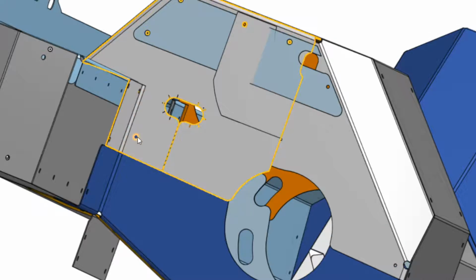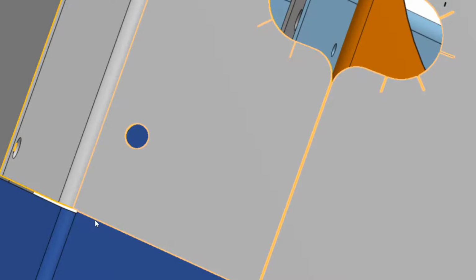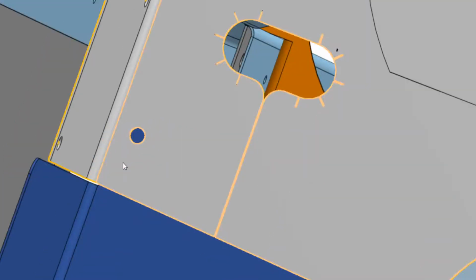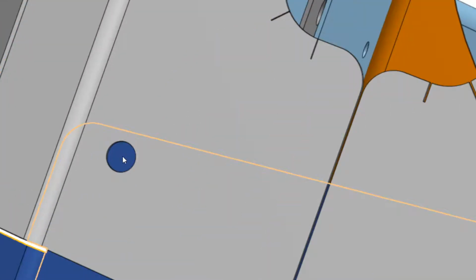There may not be a hole in the dark blue piece here to match to this one and the gray one. You can always slip it in place, mark that with a Sharpie or something like that, and then punch that hole or drill that hole to allow the screw to bite in there. If it's the smaller hole, which in this case you'd want the smaller pilot hole, it would be about 1/8 of an inch diameter, or even a little smaller than that. The screws will cut out the rest of that hole. They're a self-drilling tapping screw.